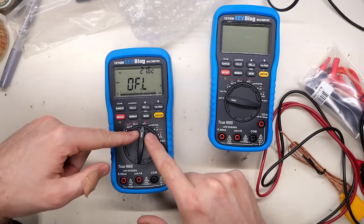Now, speaking of range switches, I have this, and this has a very flaky range switch on it. Look, it does that kind of stuff. See? It's really bad. Just touching it makes the whole thing reboot. I think sometimes I do this and it gets a bit better. And it's not the batteries because hitting it over here, it's fine. But if I just hit the range switch, that's when it sometimes starts to reboot and just do strange things. So I'm having a lot of issues with range switches on all my devices. Yeah, look at that.